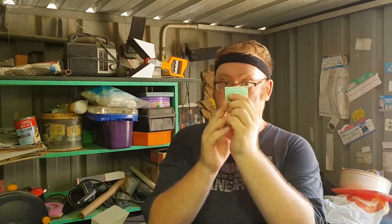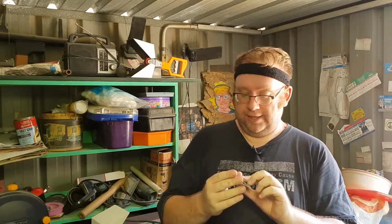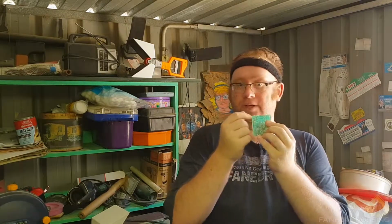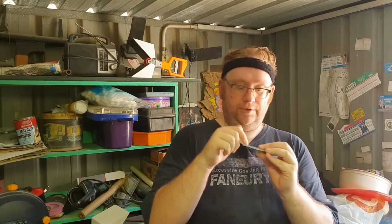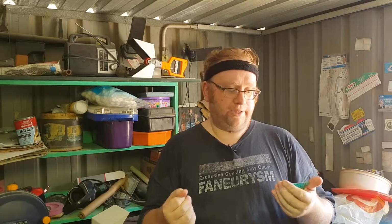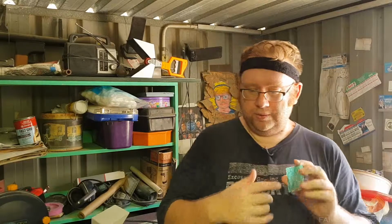These circle ones here, they're for capacitors. They have a plus and a negative because the capacitors have a line on them to indicate the negative. The icon here has a plus sign. You don't align the plus sign with the negative, you go opposite. Now you can use the visual references in the manual, they'll at least help you do that, but you've got to remember to keep these things in mind so you're not getting them the wrong way. If you get these things the wrong way, not only will they not work, things may explode, or at least pop.